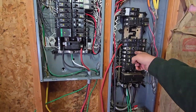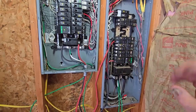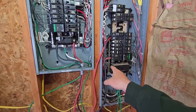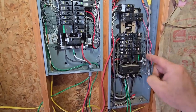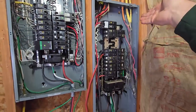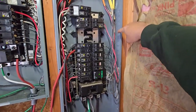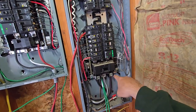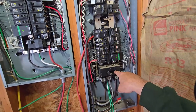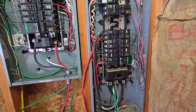You're going to pop the breaker off, take the breaker out, and undo the black load wire — that's fine. Then you reach in, find the neutral, undo it, and pull it out. Those two aren't that bad because they're insulated. But that bare copper wire — when you go up here, this panel was very full, so when you're pulling on those bare copper wires, you have to make damn sure that when you undo them they don't come in contact with those two hot lugs. You should always turn that off before doing anything in this panel.